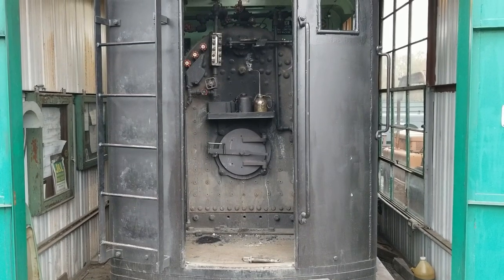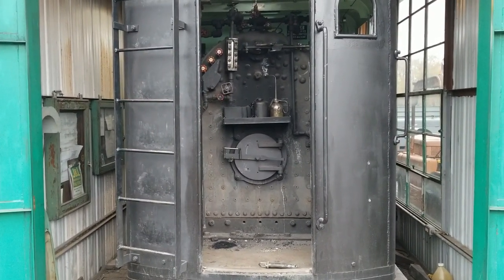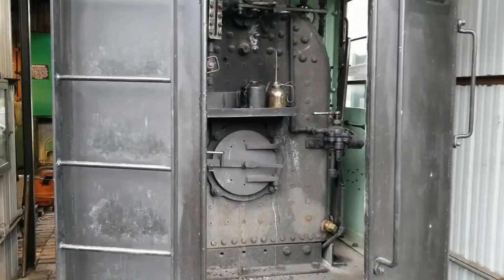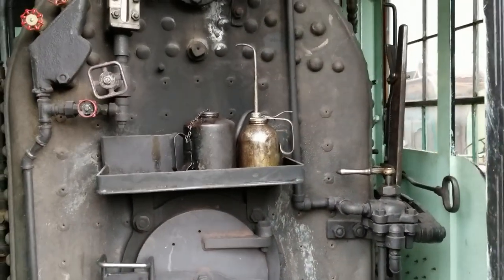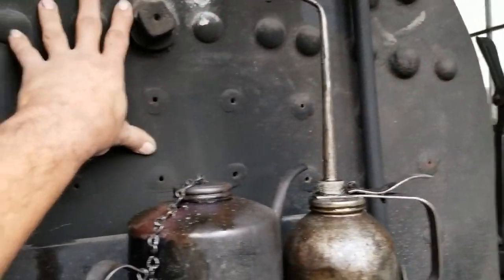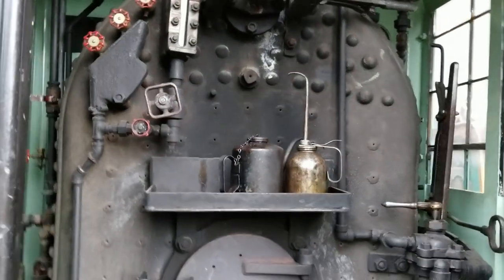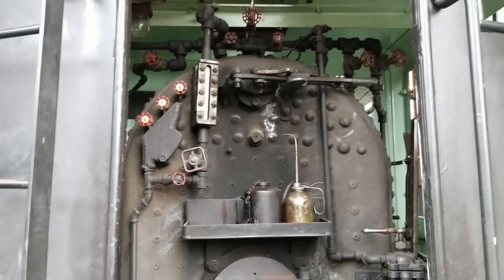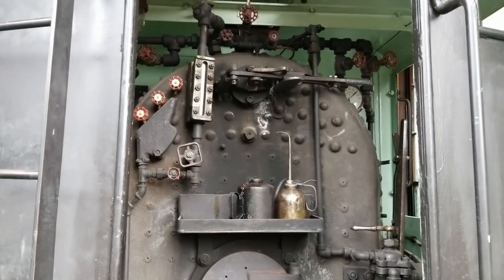We'll also start taking apart some of the areas and parts that we're going to be working on and making some improvements on the locomotive over the winter. Pretty much what we have to do is make sure that all the water has been removed from the locomotive. It's still warm from yesterday, still got the boiler full of water, which will be good because when we drain it out, most of the moisture in there will flash off and evaporate rather nicely, leaving the boiler quite dry.